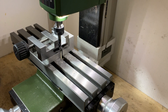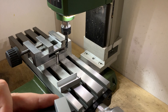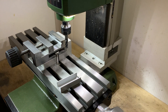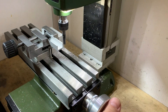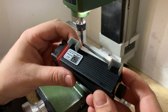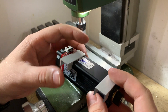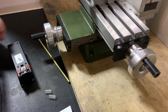First one done - doing the same for the second one. Pieces are ready. As I want to mount them like here, I need to remove these sides, and here I need to leave just 10 millimeters. I mark the line until where I need to cut, and then the same. Milling tasks on the mounting supports are done. Now the holes - holes for mounting here and here, and holes for the pipe. My supports are done and it's time for a test fit.